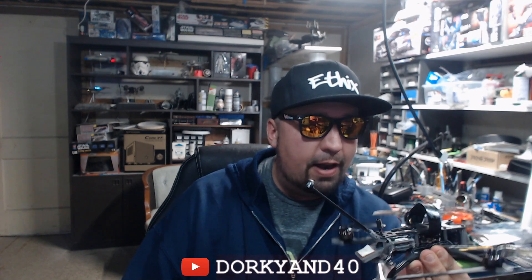Besides that, the frame itself — I really like the build quality. I'll probably rip off the padding and put some Umuu grip on there so batteries don't slide around, since that can really affect the tune on a small vehicle like this. The metal side plates for the camera are a super nice touch, locking everything in really well. Despite these maybe being rushed, the build was just fine — every screw was tight, I just tightened the TPU mount screws on each motor a little bit more.